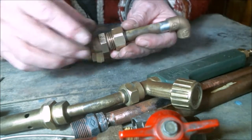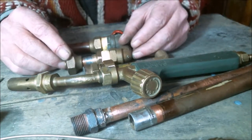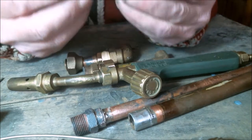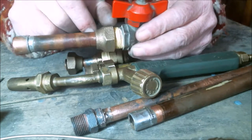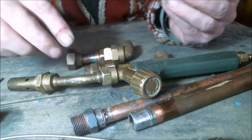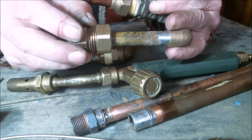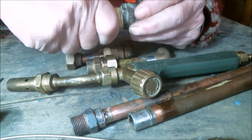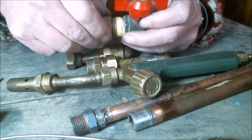For these temporary joints to work, it is critical that one part should be able to turn around the other. To create the required compression — between hard and soft metals, between metal and sealing tape, or between flat surfaces and a fibre washer — the parts have to turn. We turn them to tighten and seal, and also when we want to loosen them and separate the pipes.